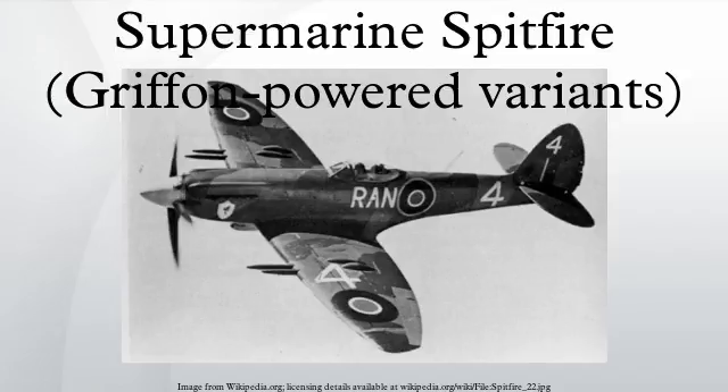Changes to the aircraft were restricted to those essential to enable it to accept the new engine. Quill found it had a spectacular performance, doing 445 mph at 25,000 feet with a sea-level rate of climb of over 5,000 feet per minute. The Mk-VIII-G, with virtually the same tail surfaces as the Merlin Mk-8, was very much overpowered and the handling in the air was unacceptable for an operational type. A new throttle box was needed giving much greater angular travel for the hand lever. The next essential was an improvement in directional stability and control: a new fin was drawn up with a substantial increase in area and a much larger rudder, fitted to the second aircraft JF-317.